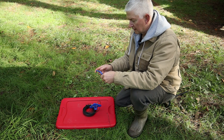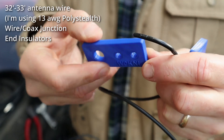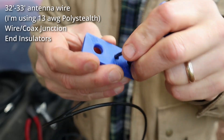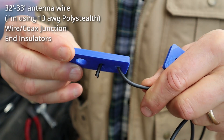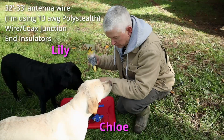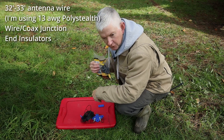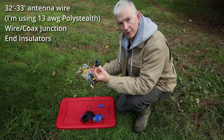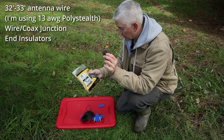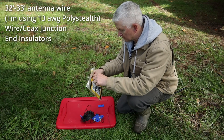On the end you're going to need a couple of insulators. There are a lot of choices — you can go cheap. In my case I made a couple of 3D printed parts that act as insulators; you run your wire through and that secures it. Another great inexpensive option: go to your local farm store and find electric fence insulators. You can pick up a packet for under $5. These work great, and they also work great as a connector if you're doing a link dipole.